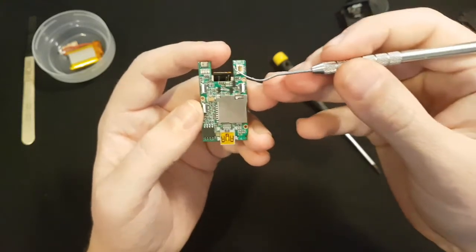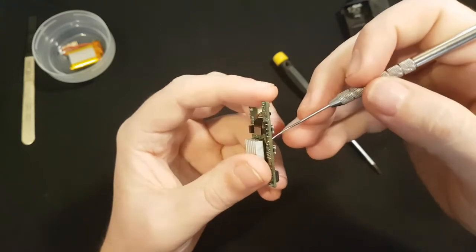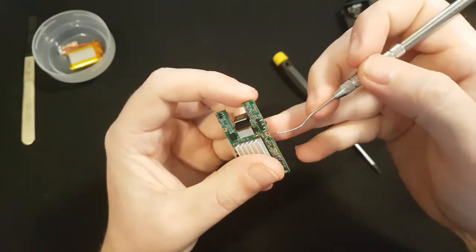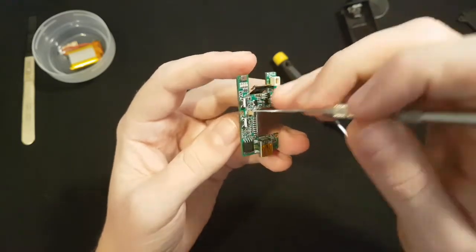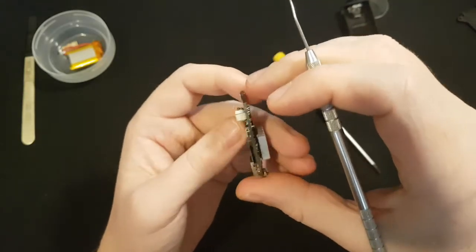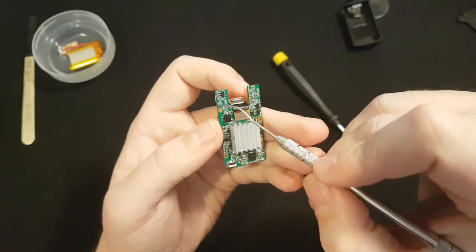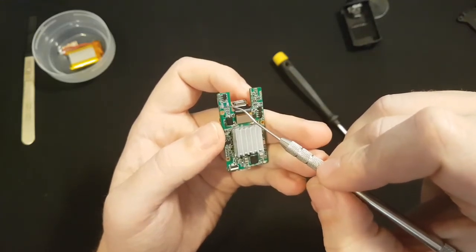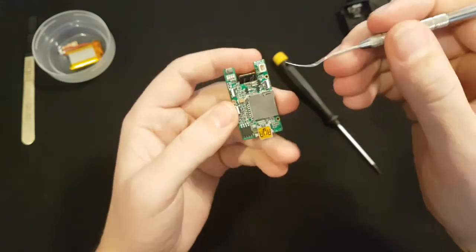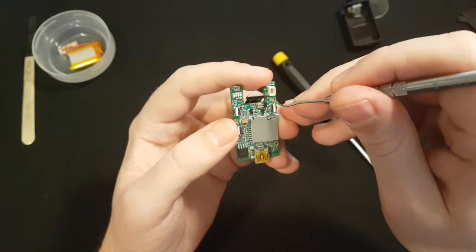If you do need to pull somewhere on the board, that area there is a good place. Alternatively, if you have something like this little dental pick that I'm using, you can actually reach in through one of these holes. The center one on the left is pretty good if you reach to the outside of the board to apply some force. Same with the top one — it's probably actually the best one because there are no components around it that could be easily damaged. One way you could pull it out is simply hook something through there and just pull on it.